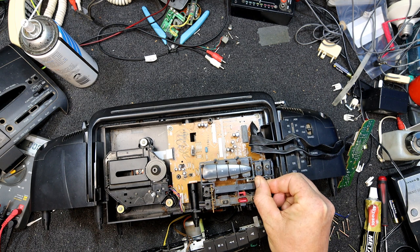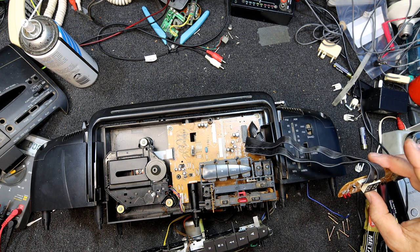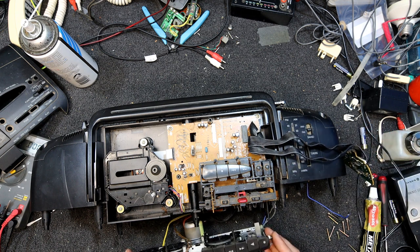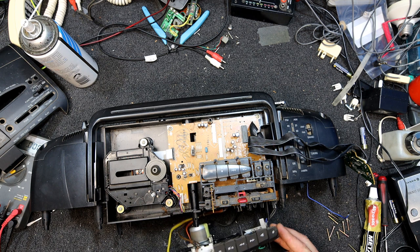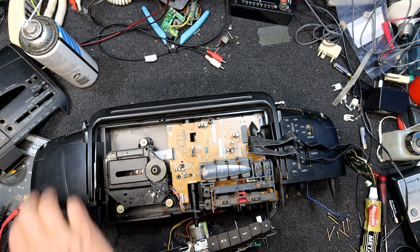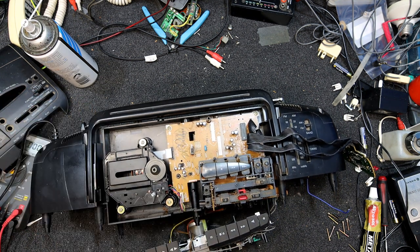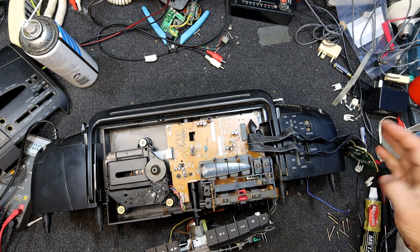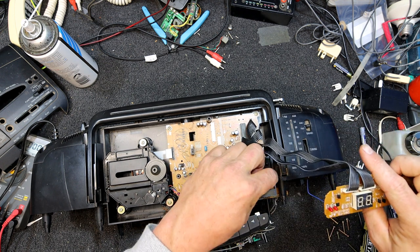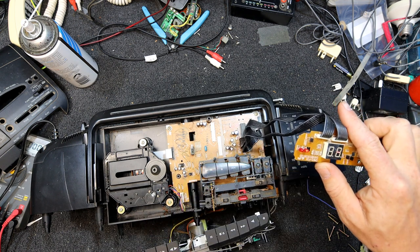Now it certainly could be that we're missing 12 volts or something in this thing, which is affecting CD and cassette. You never know. Pretty sure I'll plug that in and try it out. Find the power socket. Where's the CD display? Do we have anything lit? Oh yeah, we've got a red light. Oh yeah, CD's doing something. Where's the switch?